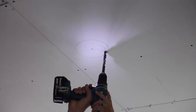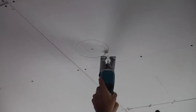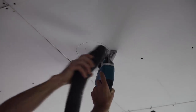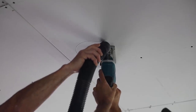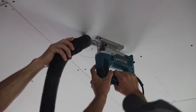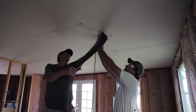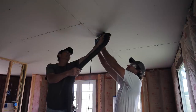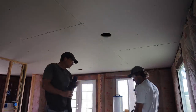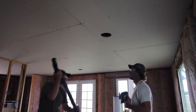Once Robert had the ceiling done, we worked on installing the recessed can lighting. Since we installed the drywall over the top of the plywood that was originally there, we thought it would be easiest to cut through both at the same time. Felt like we were doing some weird swan dance or something. But it worked well to keep most of the drywall dust off the jigsaw.